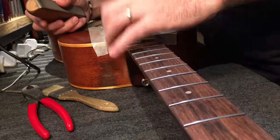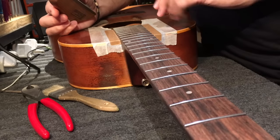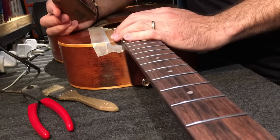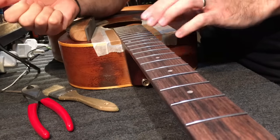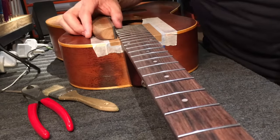One of the things we've got to do next after trimming is just cleaning up the ends. I like to clean up the ends first, then level, then do my crowning. Some people like to level slightly before trimming, but I don't like to do that because sometimes trimming the wire moves it a little bit. So at least with this approach I can see first what's going on and I'm leveling twice.